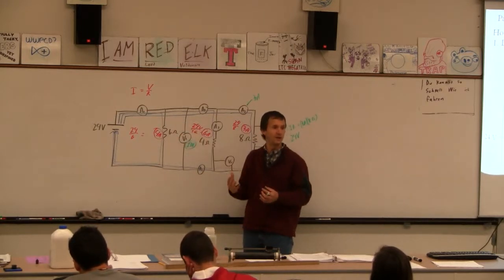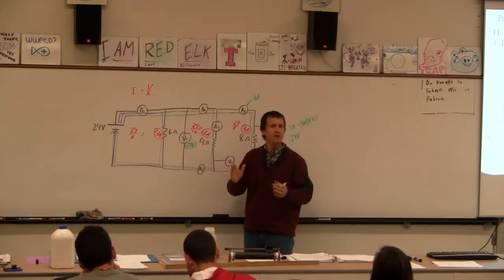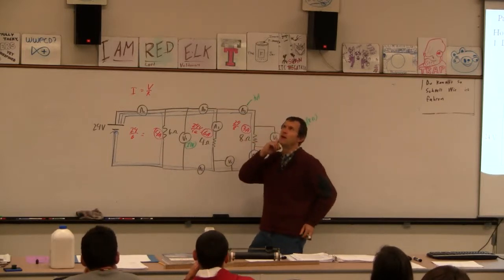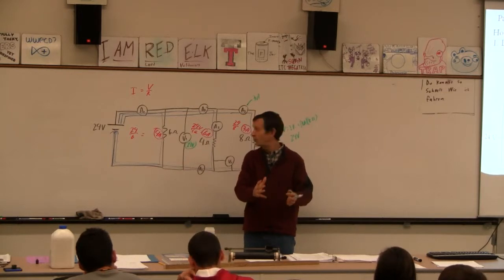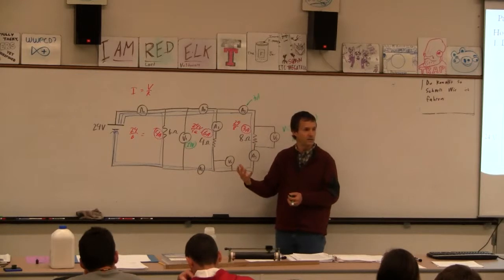And the reason for that is that it wouldn't do. In a series circuit, there are many different voltages, but all the appliances need to have 110 volts or 120 volts or whatever it is, yeah? So it wouldn't do for people to have to do math to figure out, okay, I just plugged in a toaster, so now I need to plug in the electric drill, and that would make the voltage just right. No, no, no. They're all designed to use the same voltage, and so this kind of circuit supplies the same pressure to all the appliances, right?